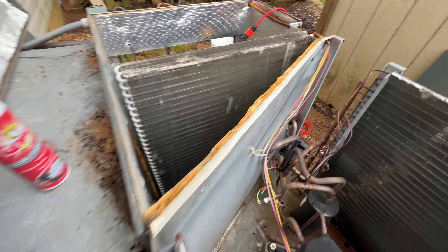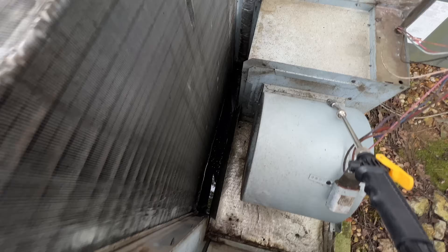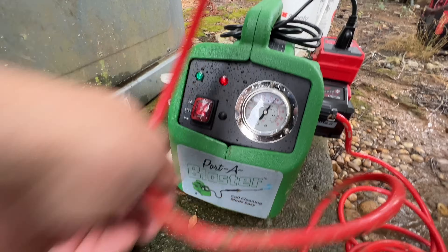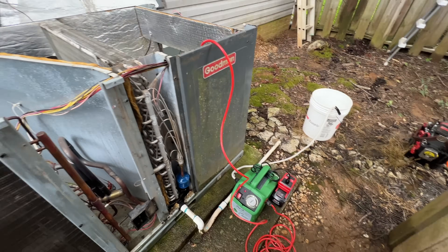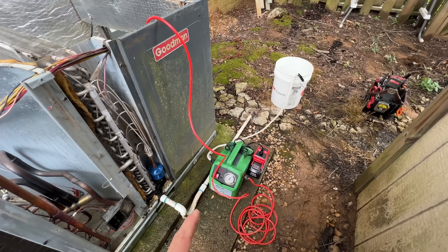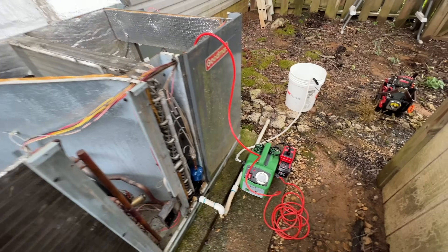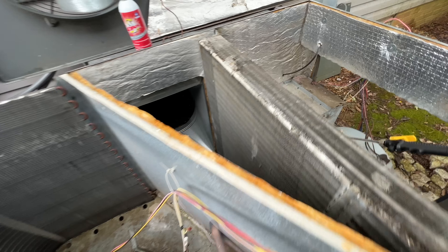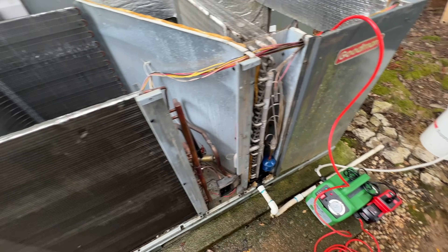This is looking a lot better now — got the pan down there all cleaned out nicely on both sides. This little portal blaster comes in handy for situations like this: ductless mini splits, indoor high walls, and things like that. It's also great if you're trying to clean a coil and don't have any water available, like on a commercial application. We got the condenser coil cleaned and evaporator coil cleaned — I'm just going to give this all a good wipe down and we can get this thing put back together.